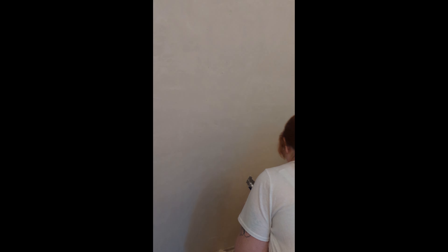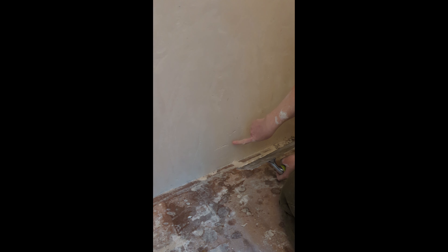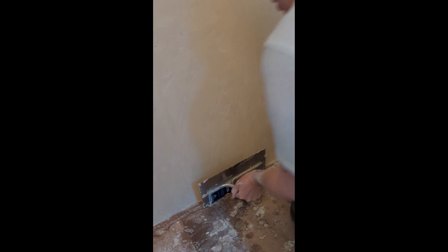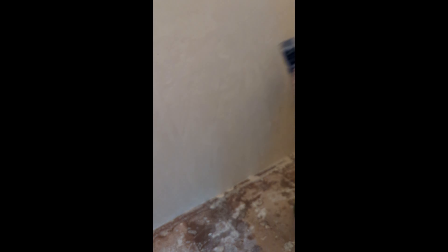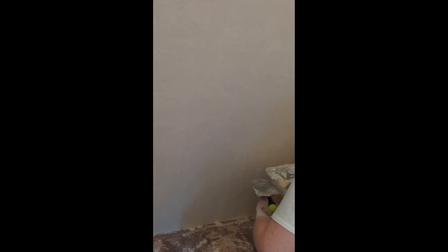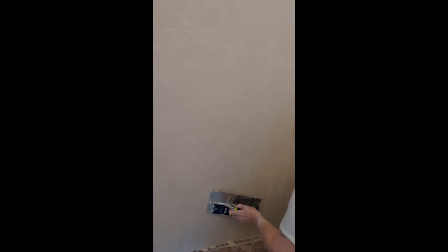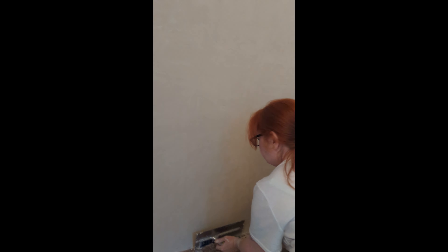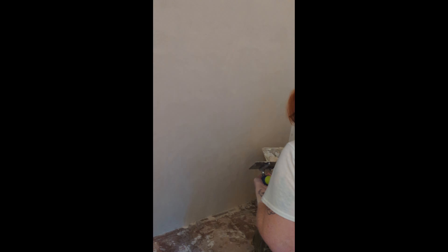This is how Shelly does it. Start lower down because you're on the wet edge - you're just plastering fresh air otherwise. And always start by throwing it on the floor. Not too much on the trowel - just go on the hole. You'll have to excuse the cack-handedness of a lefty. I think it'd be easier if I was a lefty as well. Again, on the hole - that's it - and then bring it back. So we're basically icing a cake, or a very big one.